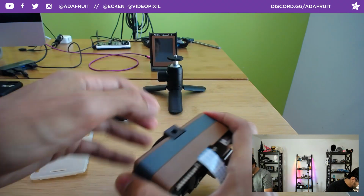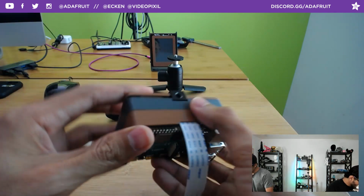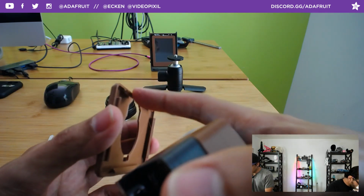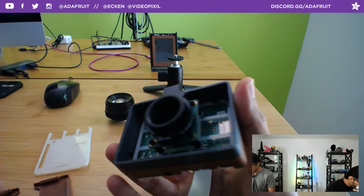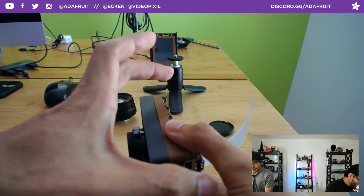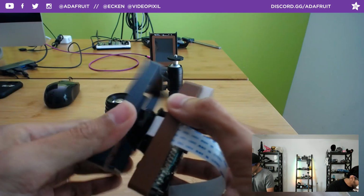Don't want that to roll off the table. And I always try to make the snap fits kind of easy to open, but also kind of difficult to open, depending on what part needs to hold it better. So these snaps here are a little bit thicker and bigger on this end, so you can take that out, and you can kind of get a look at the inside here of how it's secured. And then this extra frame here just kind of provides some more coverage, but it's still snap fit, so this comes out like that.